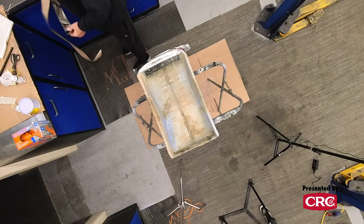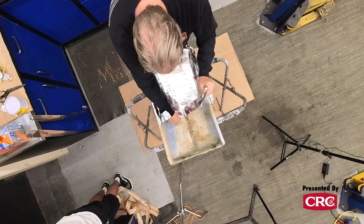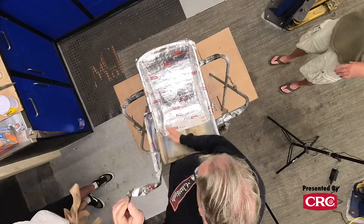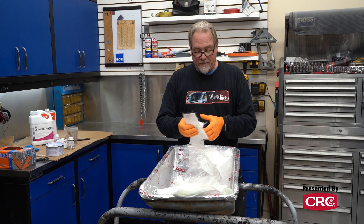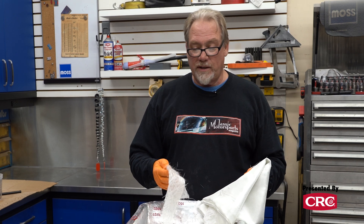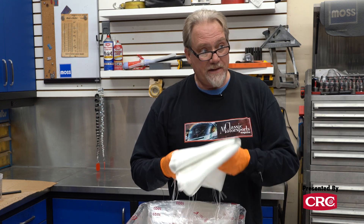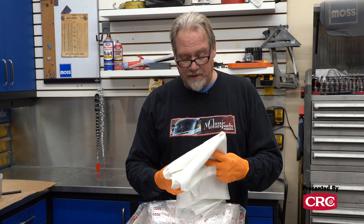So let's lay this tape down. You're going to want to press this down because whatever shape this makes will appear in the piece that you build. Next, we're going to talk about cloth and mat. This is fiberglass mat, which comes in different thicknesses. The reason mat is so popular is it is really workable — easy to get in a corner, lay flat, and come up and around something. Because it's a seat, we thought it would be a good idea to put some cloth down too.